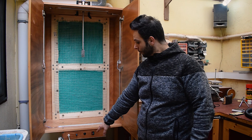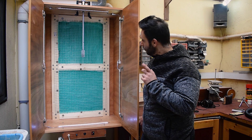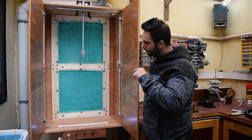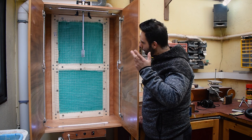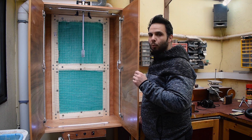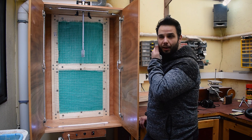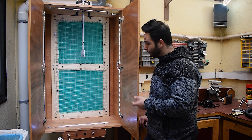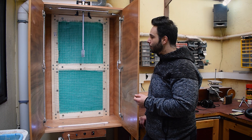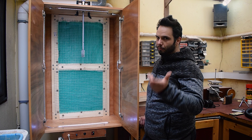The first switch on this panel controls the light. Inside I have around six LED strips — one on the top, one on the bottom, and two on each side — so the whole space is fully lit with a nice cool white light. It's important not to go with a warm white, that yellowish white, or else the colors won't show clearly. And since it's going to see flammable fumes, it's a good idea to go with LEDs rather than normal bulbs.